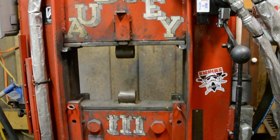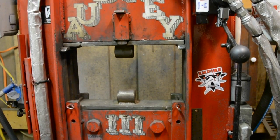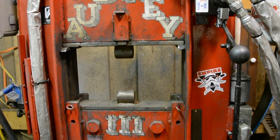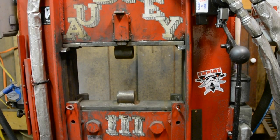I wanted to take a second to talk about the tools I'm going to be using since I'm by myself. I'm going to be using a 50-ton hydraulic press instead of hand hammers to do this. I do have a video on my YouTube channel of us upsetting a hardy tool with hand hammers — if that's what you'd like to see, go check that out. Right here I've got fullering dies on the press, and that's going to help me draw out the shank. From there I will hand hammer and smooth up the taper.